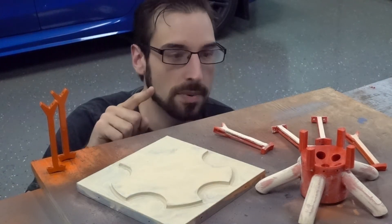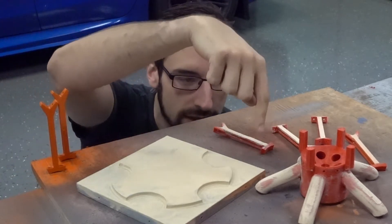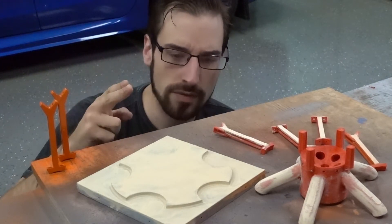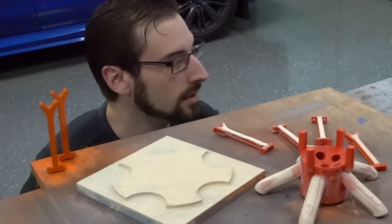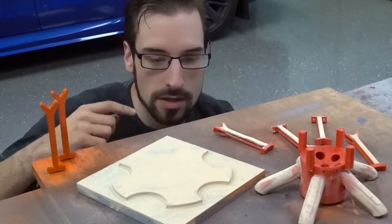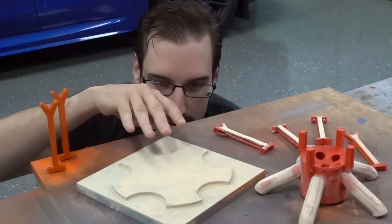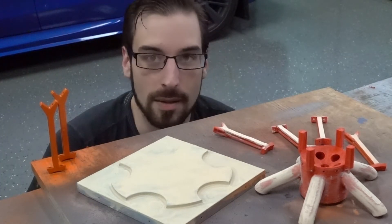To finish parts, I'm still working on my process — filling the little cracks and imperfections with wood filler and then sanding it down. I've started adding a little bit of water to the wood filler and using a glove to spread it around, so the less viscous solution seeps into all the little cracks and it's a lot easier to sand. Then I'm going to paint them.